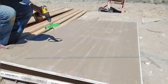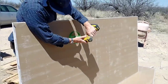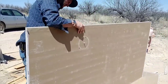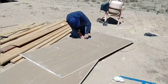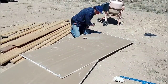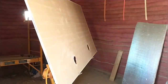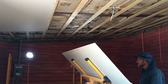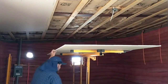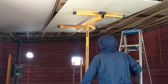Unfortunately, Kyle did hurt his shoulder during the process and needed to take a few days off, so when I got back I took over to finish up the ceiling. Here I'm using a purpose-built tool to create the right-sized hole for the recessed lights — we're using 6-inch recessed lights, with an actual hole size of 6 and 3/8 inches. This tool is so easy, done in just a second — so much easier than doing it by hand. Here April and I are bringing in a board — whenever she's around she gives me a hand because they really are quite heavy.